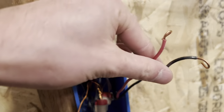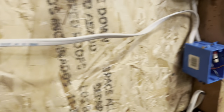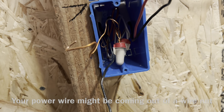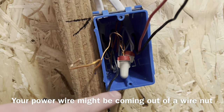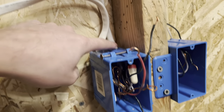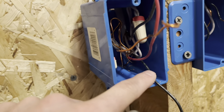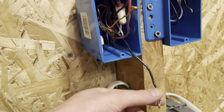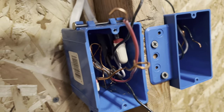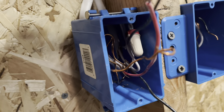The easiest way to identify the wires if you've confused them: inside the box you're going to see two wires coming in. One of them is going to have your red and black wires together coming from the same Romex inside the same sheathing — that's how you identify your travelers. And then the single wire with just a black, white, and ground — that's your switch leg.